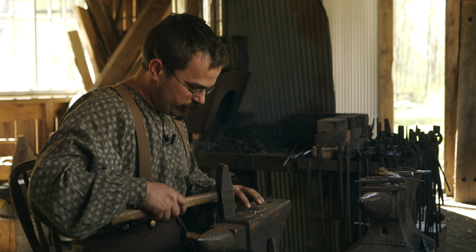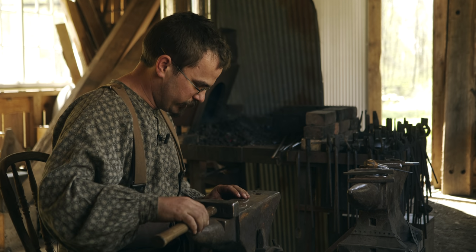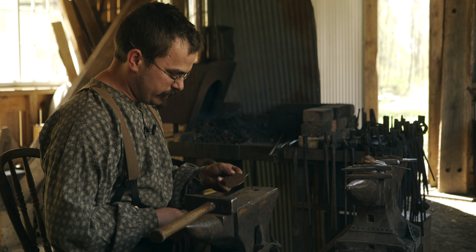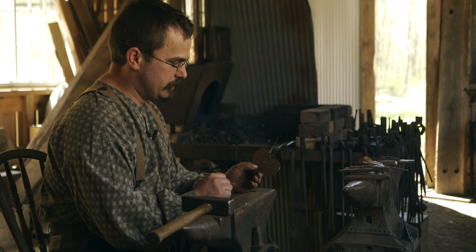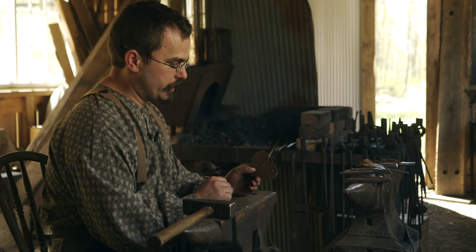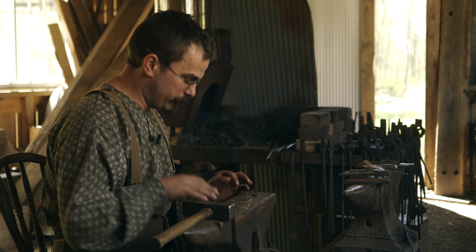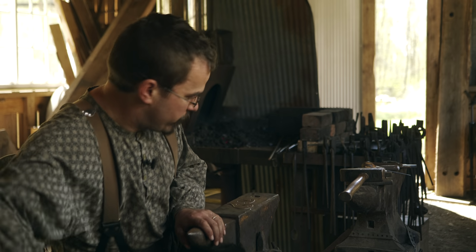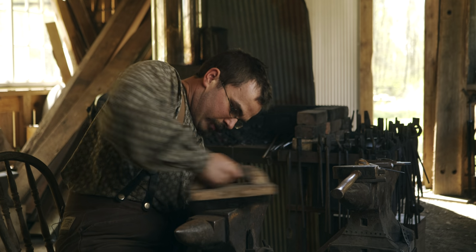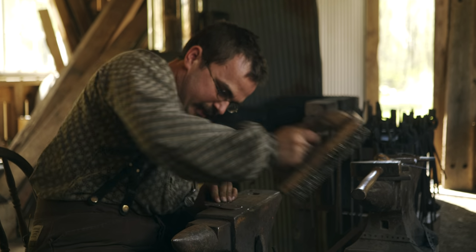And these, I punched from the back side of the plate intentionally so that I would get that slight countersink effect on the back side. And that will just help the tenons lock in that much better when I peen them over. Now, I'll refer to that later when we rivet the tenons in place.